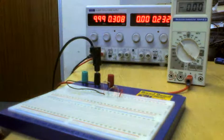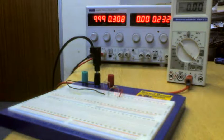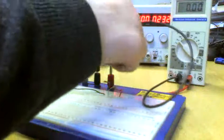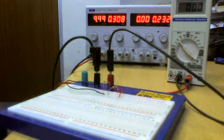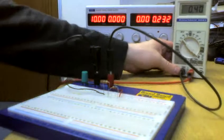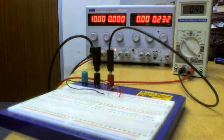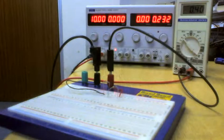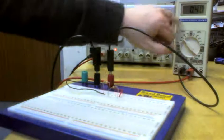Now we need to complete the circuit from the common socket back to the rest of our circuit. At the moment it's measuring zero current because our power supply is switched off. As soon as I switch it on — hey presto — we are measuring a current. It's actually measuring 0.4, and since this is on the milliamp range, that's actually 0.4 milliamps, which is 400 microamps.